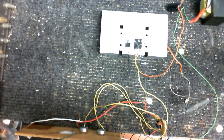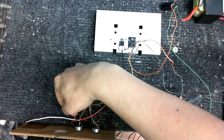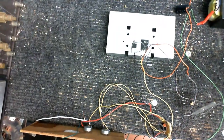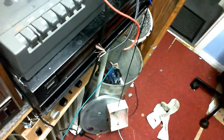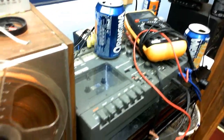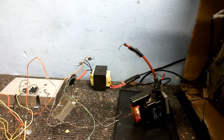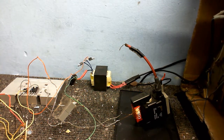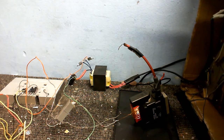Let's try the singing arc. I've connected audio from my tape recorder, which is going into this wire here, so that's going to offset the pulse width - we're going to modulate the pulse width. That's the audio from my multi-track tape recorder. I've got tape playing now. I'm just going to turn the power back on. I've turned the frequency back down to 15kHz so we're not going to get any more pin-to-pin arcing.